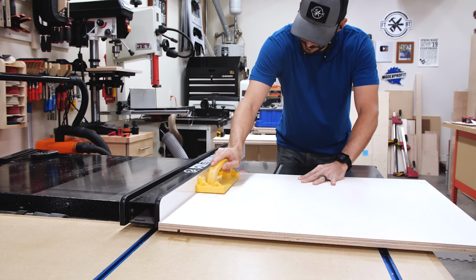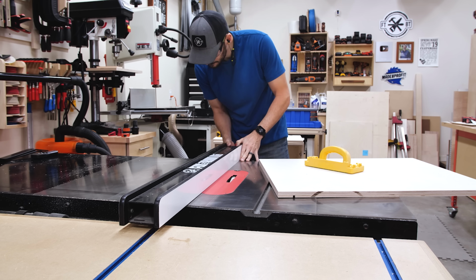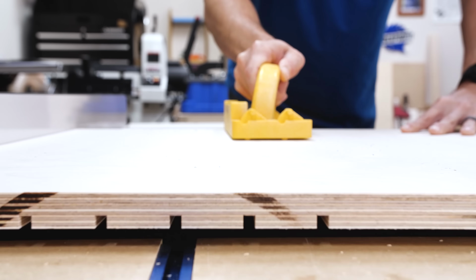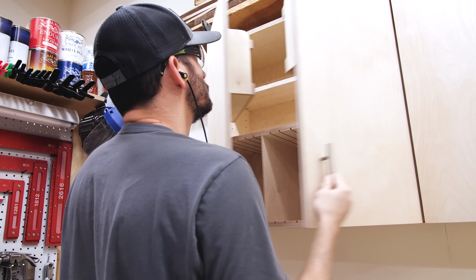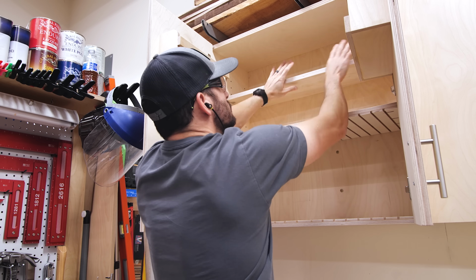On the second one, I wanted some adjustable storage cubbies on the bottom. So what I did was make some grooves on the bottom with a dado blade, and then made some panels that I could slide in there. Basically you can pull it out and adjust it to make it whatever size storage you need for what you're going to store in there. On the top, I just did a regular adjustable shelf, so I drilled some shelf pin holes and used a half-depth shelf. After getting all the carcasses assembled, I went ahead and finished everything and then got them ready for assembly up on the wall.